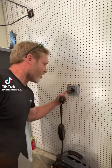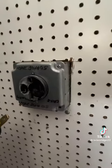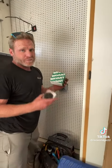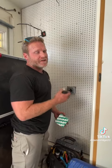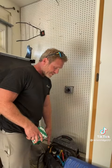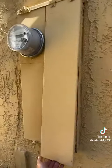This customer has an electric car charger in their garage that melted after they plugged their Tesla in. We've had this situation happen a couple times, and the solution is to buy this Bryant NEMA 14-50 outlet, which is about $50 more than your standard NEMA 14-50 outlet. We're going to replace this outlet with the heavy-duty outlet, and she'll probably need a new male connector for the Tesla because that one is all melted.